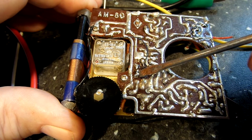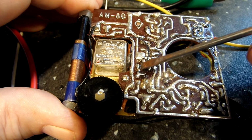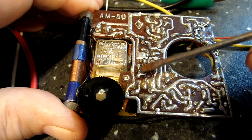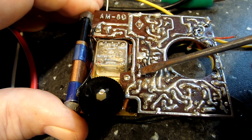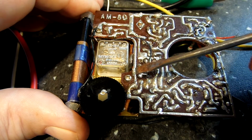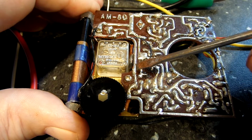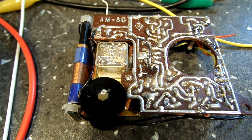There should be a 1500 ohm resistor there. I'm going to try to measure that. Before I go to all the trouble, I'm going to take this out, take the transistor out. I've got the soldering iron heating up. And get that out and get all this changed around like I want it. In other words, I want to measure this transformer, or the resistor in here. Not so interested in the cap because they're little disc caps. They don't usually go bad, but resistor can change value. So, like I said, the reading on that was a little bit low, if I recall. So you know, it's possible that has changed value, and that may be our whole problem there. So I don't know, but we're going to find out. And like I said, we will do that shortly. Like I say, as soon as I get my soldering iron all heated up and get me some solder wick out here, and we're going to go for it.